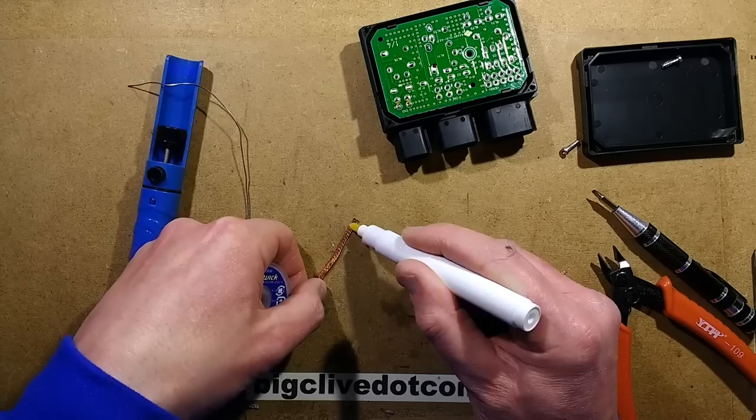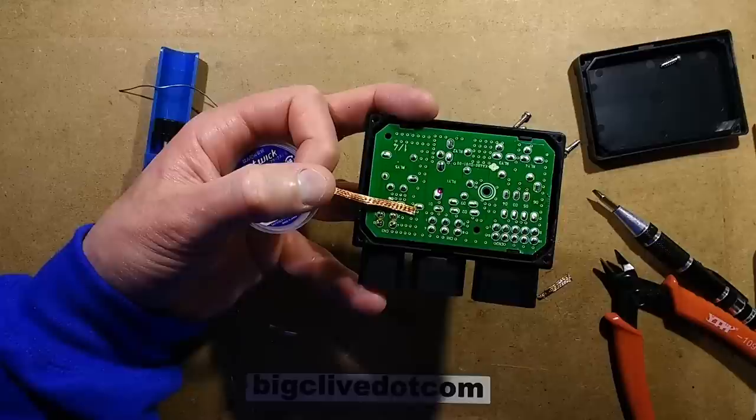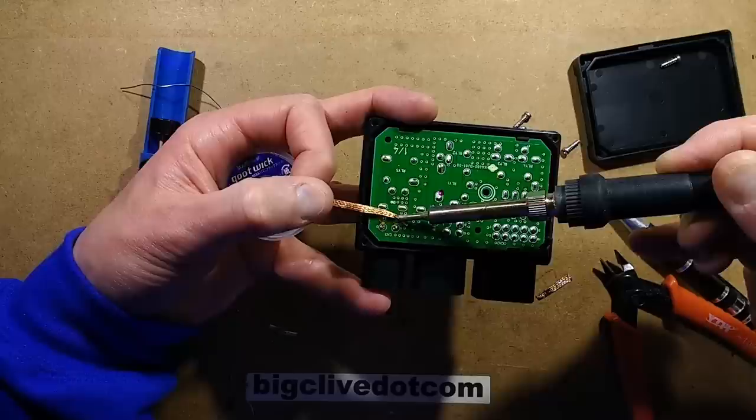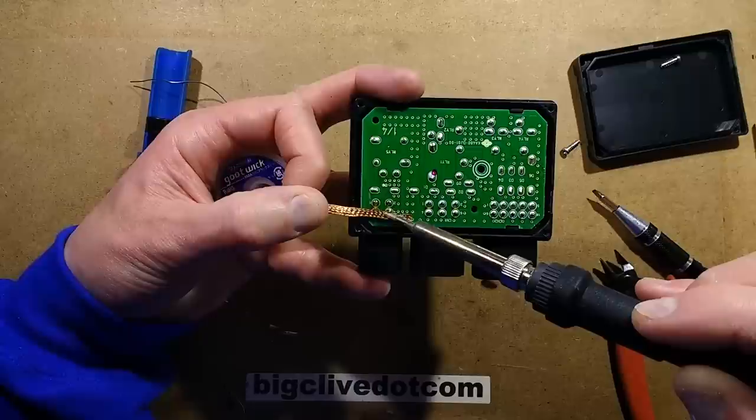At the risk of leaving a big skid mark on the bench, I'll just do it straight on the bench. Yes, I've left a slight skid mark — that's alright, it shows that the flux is coming out. Let's raise this up a bit closer to the camera and see how well this is going to desolder. They're quite big — the connectors are quite big joints, so it may take a little bit more effort to desolder.